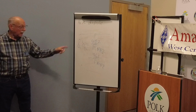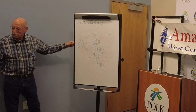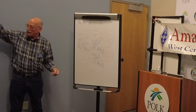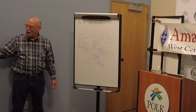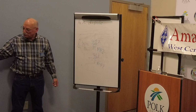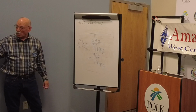And it was mentioned earlier about SWR. Okay, higher on the low end of the band or the high end of the band? Maybe higher on the low end of the band. Higher on the low end of the band, which means the antenna is too short? Too short, because you need more wire.